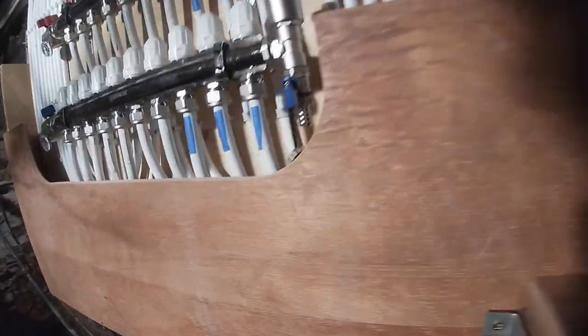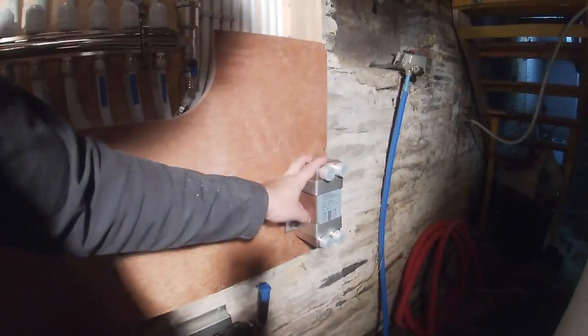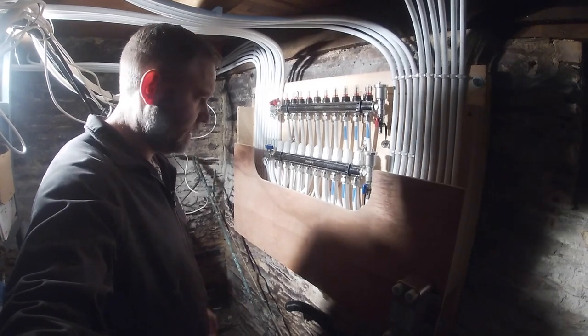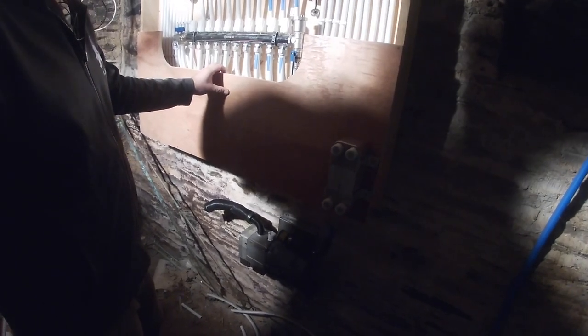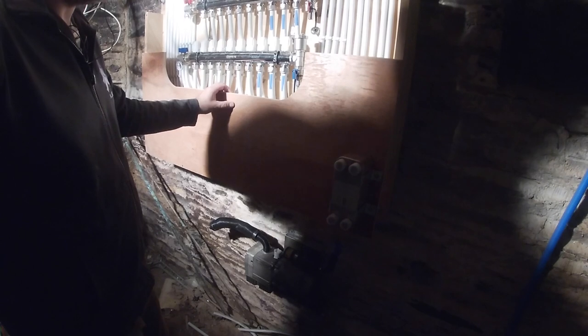I'm running out of space but I've mounted the heat exchanger as it's the component that goes furthest to the right. I've got the board in to surface-mount the pipes. My next plan is twofold: connect the diesel heater to one side of the heat exchanger, and on the other side run a central heating pump, thermostatic mixing valve, T-junctions for an expansion tank, a safety blow-off valve, and a filling loop.